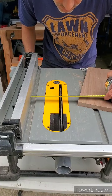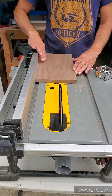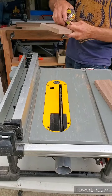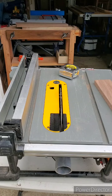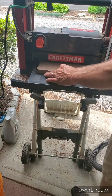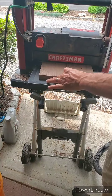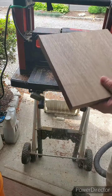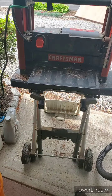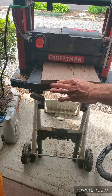I'm missing the thickness planing footage, but this is the piece of 4-quarter from the previous segment milled down to three-quarter, and I'm now cutting the width of the apron — I believe it's 4 inches. I found some footage of the final milling of the piece I'm going to use for the drawer. This was originally 4-quarter; I'm milling it down to three-quarter. That board I'm throwing behind it is just to reduce the snipe — I get snipe on the back of the board on my planer, and that second board keeps the cutter heads from causing it.